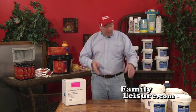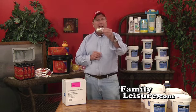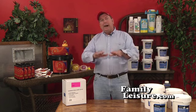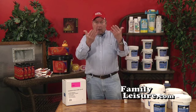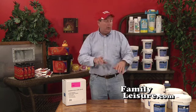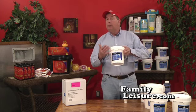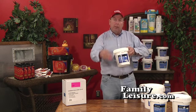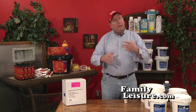So you're just going to keep adding chlorine. On the test strip, sometimes I'll get the chlorine level up to ten parts per million just to kill that algae and get it done. As the algae dies, it's going to start falling to the bottom — we'll talk about that in a second. It usually only takes three, five, sometimes seven days to get all that algae killed and falling. You're going to want to keep shocking the pool with the blast — almost every other day, a pound of blast per ten thousand gallons — because you want to keep reactivating the chlorine and keep it active.